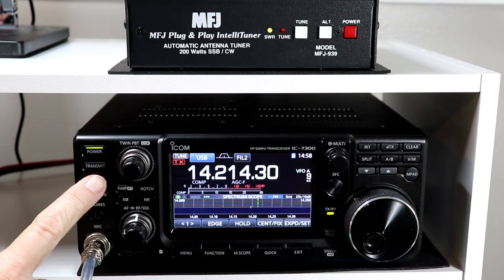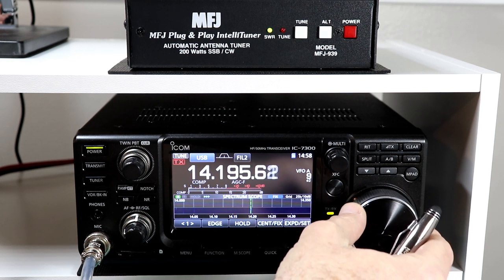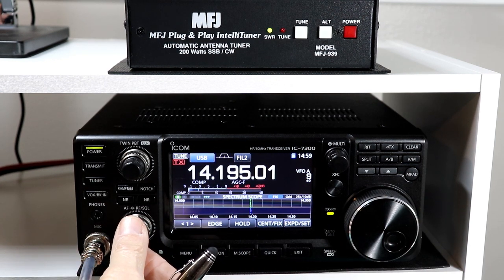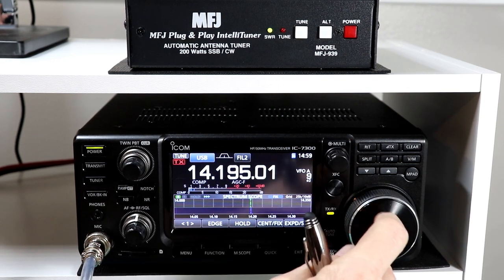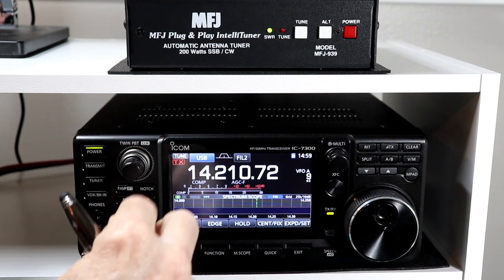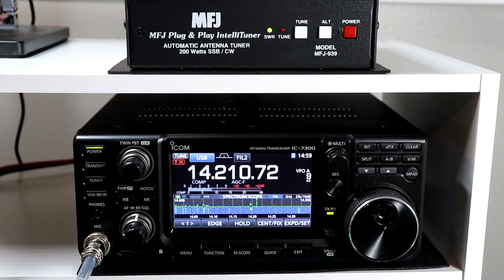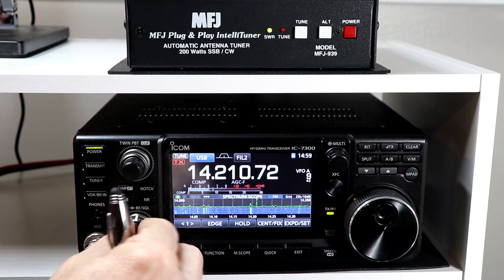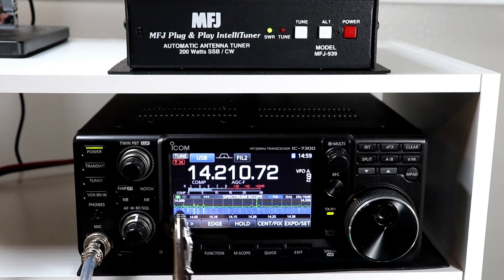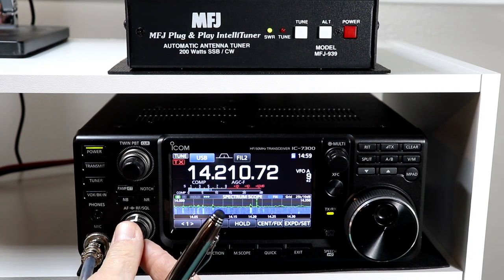My S meter reading is just pegged at zero and there's nothing there. So let's try to tune the antenna for 20 meters. There's somebody talking there — let's see if we can catch him. We're copying one person on 20 meters; he's probably either running a lot of power or may be very close. Let's try tuning the antenna now for 20 meters. You notice that the signals came up quite a bit and you can see several other signals, including signals down in the CW part of the band. So the tuner is actually quite effective, especially if you have a compromise antenna such as I have.